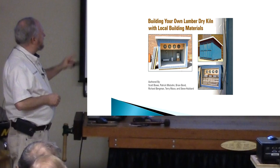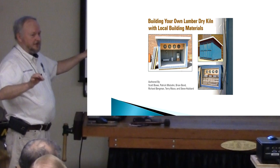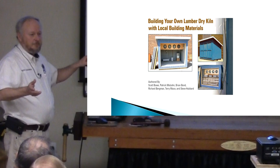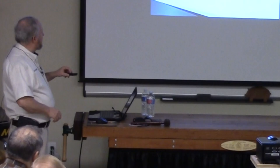I found this publication while doing my research — a very good resource on that type of kiln. You can see the dehumidifier in the back. It's very similar to a solar kiln but without a collector; you have to have some sort of heat source in there. The heat from the fans might even be enough. He has four added fans in line. Even with a dehumidifying kiln, you have to have airflow — you have to keep that air moving all the time — but you can use cheap fans. You don't have to use anything fancy.